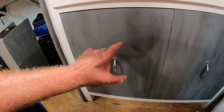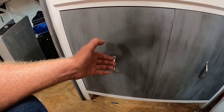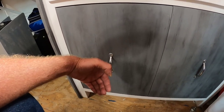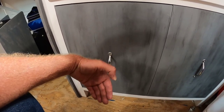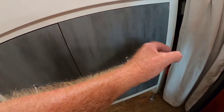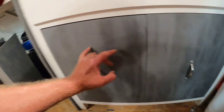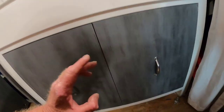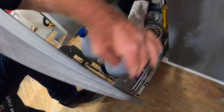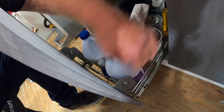So then, using the other technique with the sticky pads, we pushed that drawer up against this one. We were able to screw it to it after we just pulled it out a little bit. And then we repeated the process. We had to realign this one back up again afterwards, after we got this one in place. And then we were able to make fine-tune adjustments because you do have an adjustment on the top of this bracket, in and out. That's the only adjustment you have.